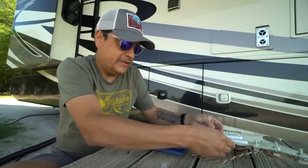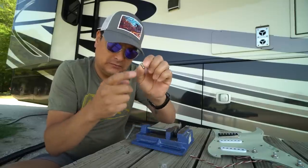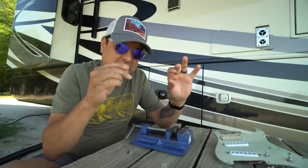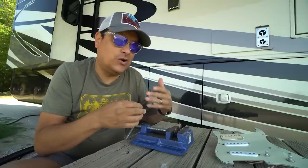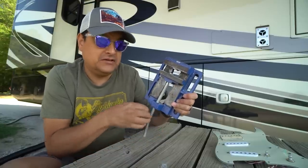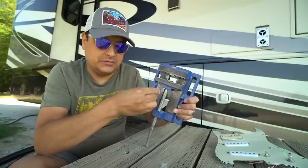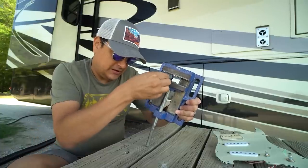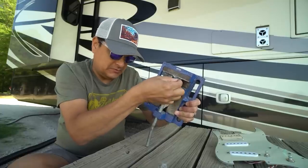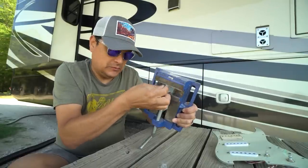Every time we have a magnet in a pickup, we need to magnetize it. Here's a pole piece magnet for a Strat pickup — just a normal loose one. I typically wind the pickup first and then magnetize it. We use this very simple device — basically a flat vise with two magnets polarized opposite each other. We pass the magnet through it a preset number of times, then check the gauss to make sure it's what we want.